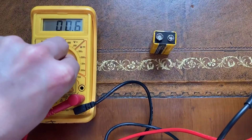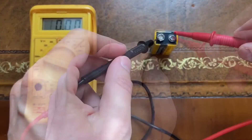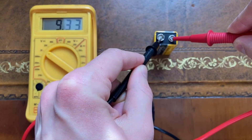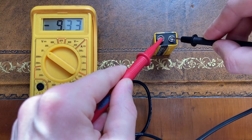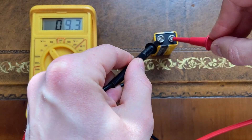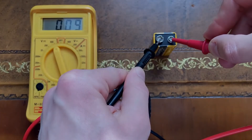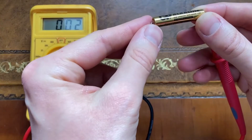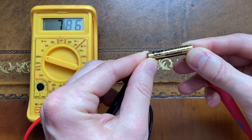Since I didn't know what the battery voltage was, I turn the dial up a notch and test again until — bosh! My multimeter shows that my battery has a potential difference of 9.33 volts. Swapping the leads around shows the same thing but negative, and changing the scale gives the same result only to a different precision. Be sure to change the settings to get as many significant figures in your reading as possible. Here I try a 1.5 volt AAA battery — it's clearly past its best with only 785 millivolts, that's 0.785 volts potential difference across it.